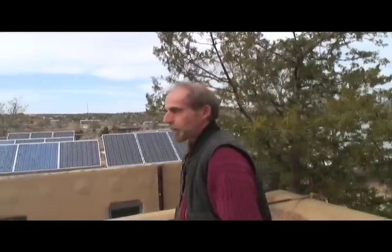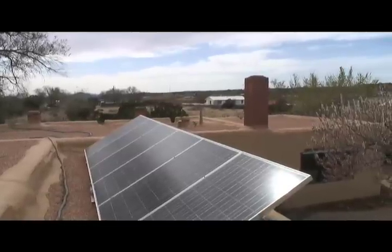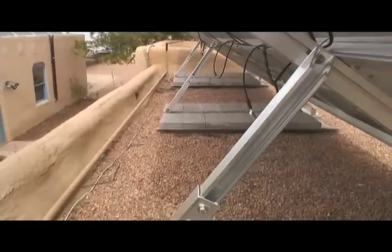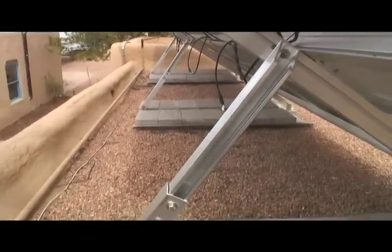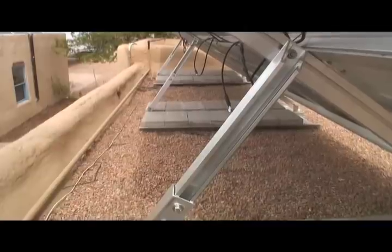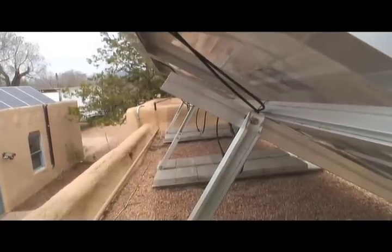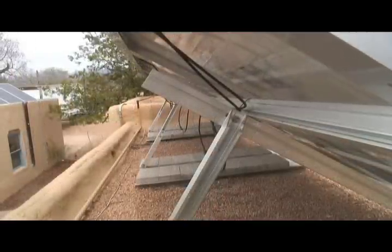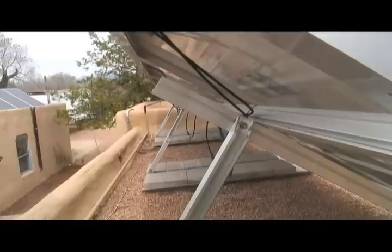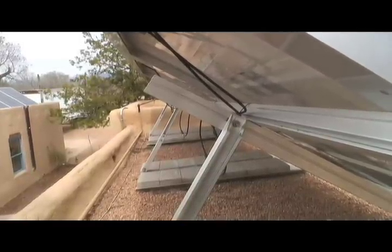That is more than enough for a normal household. We use what's called a block ballast rack. We see pans sitting on top of the roof filled with concrete blocks to weigh the whole rack down. It will not move if the wind isn't picking up above 100 miles an hour — that's what they're guaranteed for. It's made from aluminum.